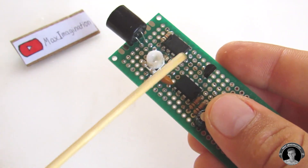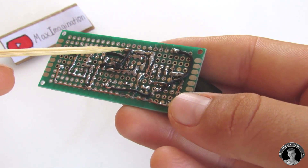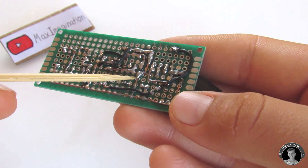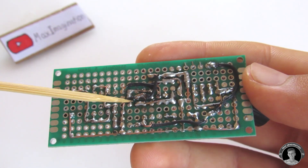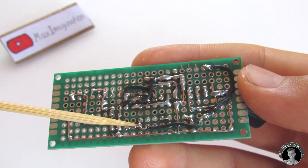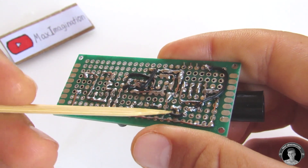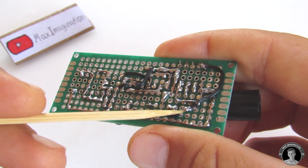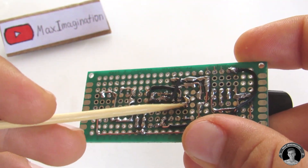Right now I just covered this side of the circuit board. From the marked end of the transistor there's a connection going down to pin 4 of the LM358 and then down to the ground rail. The unmarked side of the NPN transistor goes around and hits a 10K resistor which connects to another 10K resistor and then to pin 8 of the NE555. That same point has an overlapping wire which connects to the end of the potentiometer that also goes to pin 8 of the LM358. This 10K resistor goes from pin 8 to pin 4 of the NE555.